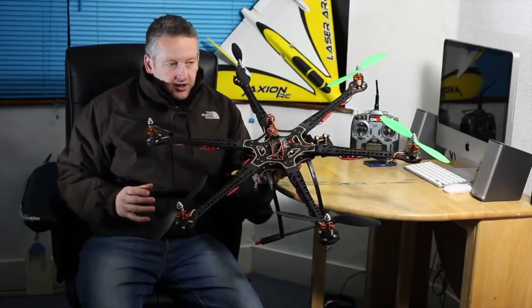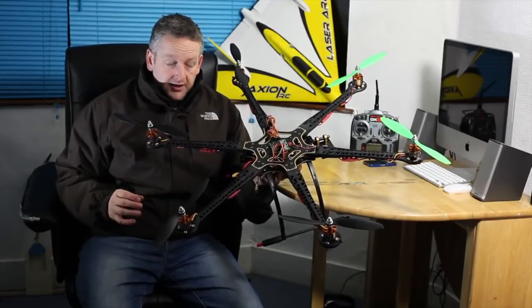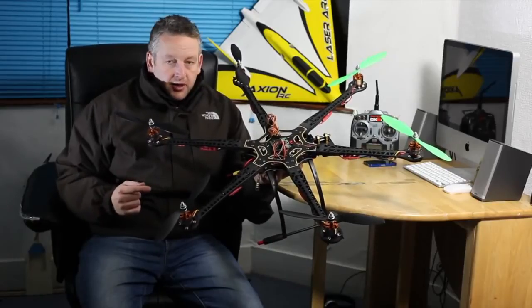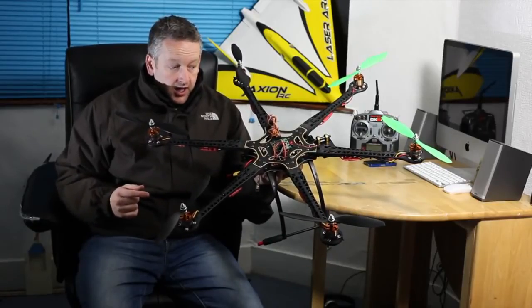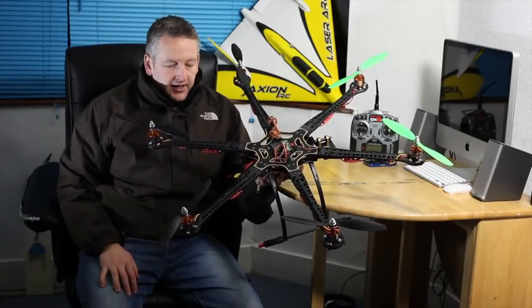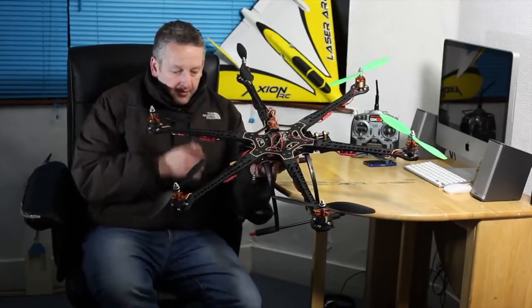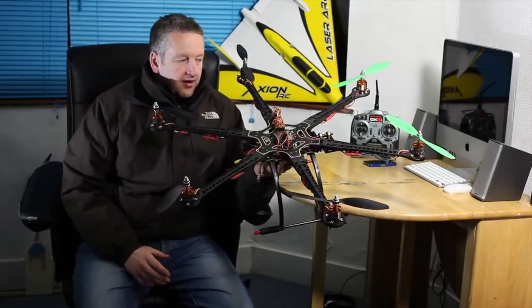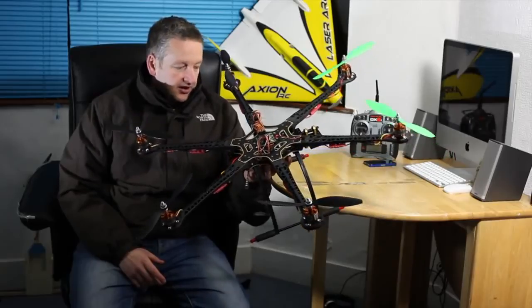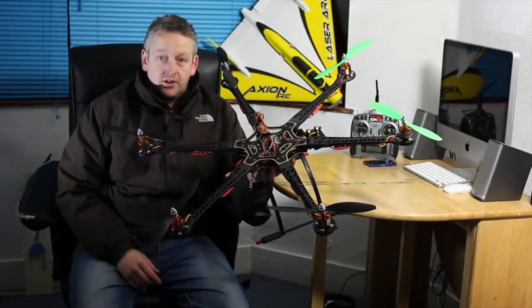The KK, just so you know, we factory defaulted it because it's come out of another aircraft. And we did a sensor calibration test and told it was a hexa and nothing else. So that's as raw as the KK gets. So that's done. We're really happy with that. And I think a little bit of playing around with the board, she's going to be a lovely stable ship. It certainly showed promise right from that first flight.